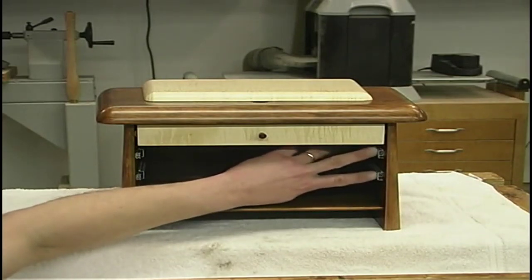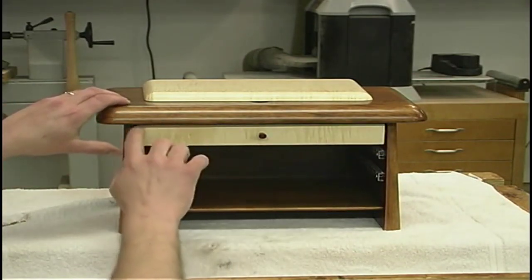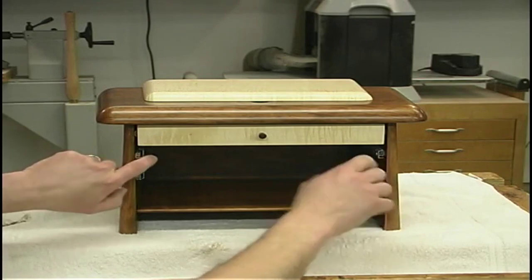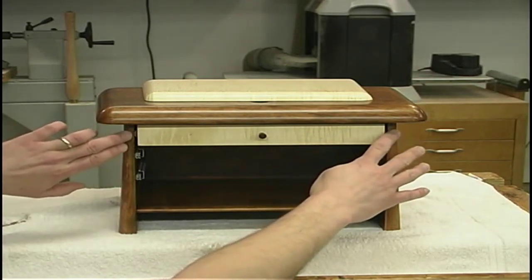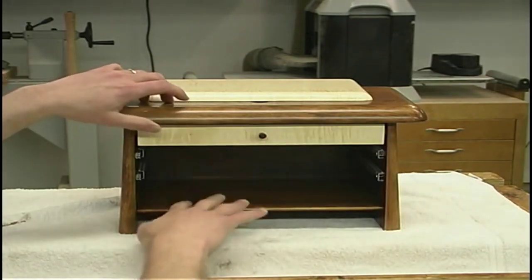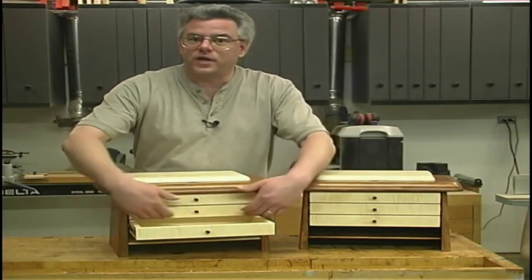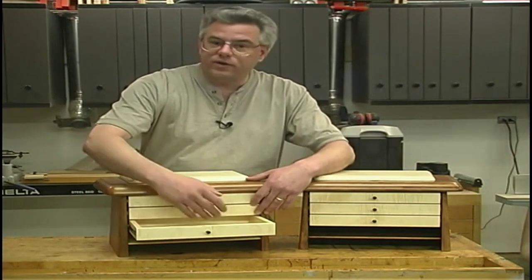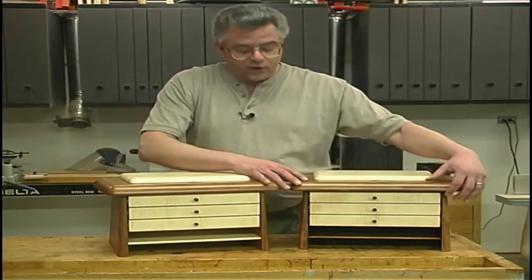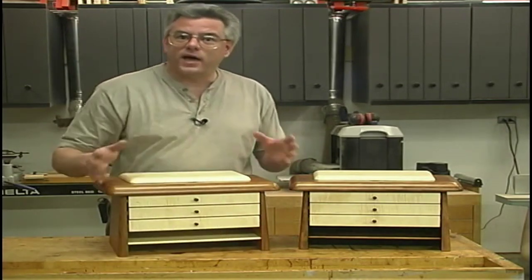To install the drawers, I first install the slides into the cabinet sides. Then I place the top drawer in position, slide it in, and check for my gap along the top — I want that to be nice and parallel. Once I get that adjusted by moving the slides up and down a little bit, I'll tighten up those screws holding the slides tight against the side, then install the machine screw that goes from the inside of the drawer into the slide itself. Then I'll repeat that process on the next two drawers. That wraps up the construction. I spent about an hour working on the drawers getting them lined up nicely with gaps running parallel to each other. Keep in mind that these are not full extension drawer slides so you won't have full access to the drawer. This one is the cherry and maple unit; this one happens to be jatoba with a maple shelf below to add a different accent to it.